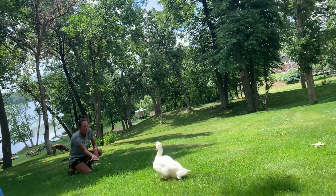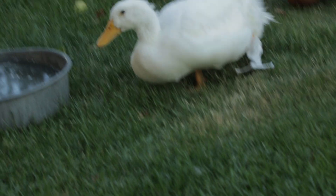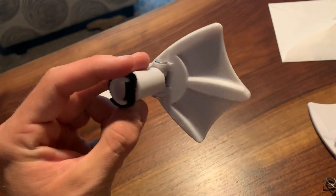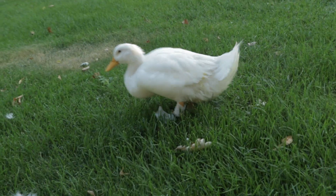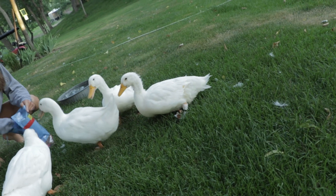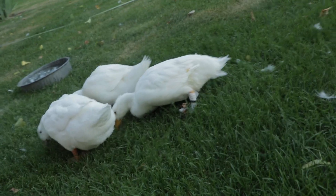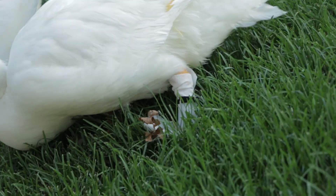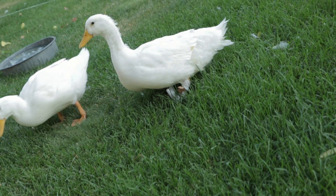Just like other pets, it took a little enticing with food and friends to get her walking. The hinge spring on these prototypes was too strong for the duck's weight, and therefore the hinge wouldn't rotate as the duck couldn't press down the foot. After brainstorming with the owners while watching the duck hobble around, it was clear that the range of motion of the shaft was far too much as it went past 90 degrees, and the foot repeatedly rotated to the point where the duck was practically back to walking on a stump. Although I was slightly disappointed, the experience gave me a whole new level of motivation as I now had a strong grasp on the general size of the necessary foot and how much the duck weighs in relation to the prototypes.